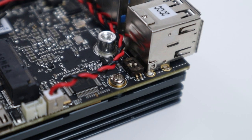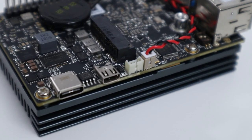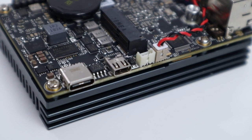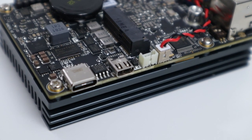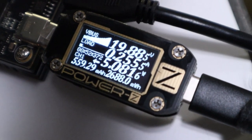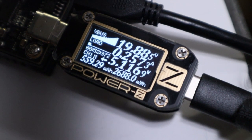Looking over to the side, you have this little switcher with one and two. When you plug in power it'll automatically turn on, and the second button is to set it to firmware mode. Then you have the real-time clock battery, and three little pins for the power and reset button. Then you have a micro HDMI and the USB-C for power, which requires 20 volts and 3 amps. You need a power adapter with switching modes for 5, 9, 12, 15, and 20 volts for it to kick on. It is not as power efficient as the Raspberry Pi, but it does work off USB-C.